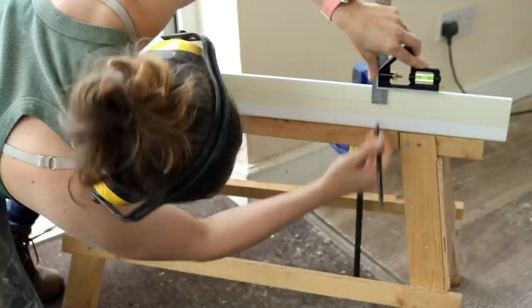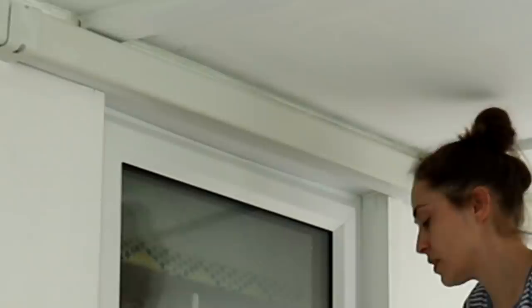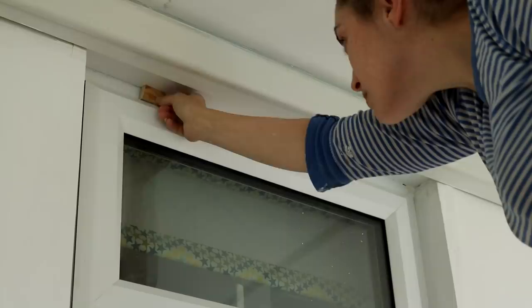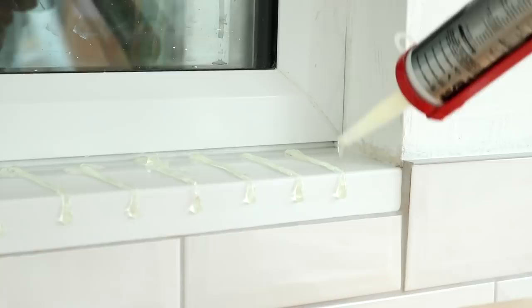I also did the sides, though I didn't get that on film. After cutting the trim for the top piece, I pushed it up ever so slightly to use some grab adhesive. The reason it's held in place is because it's tucked above either side, but because it was sagging I cut some scrap pieces of wood to about 20mm and trapped them between the top of the window and the trim so they'd stay in place while the glue set. Once the silicone on the windowsill bit had dried, I applied rows of silicone — which also acts as an adhesive — for extra strength, and pushed it into place. As usual, I'll leave all the links to things I'm using below.